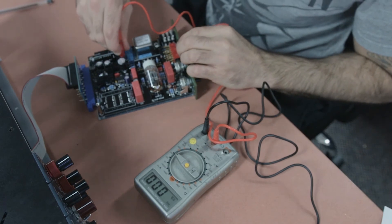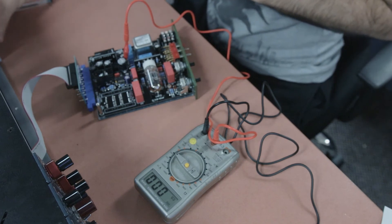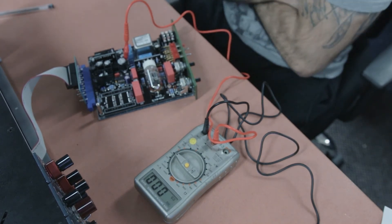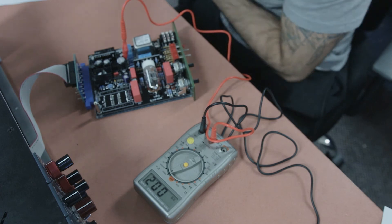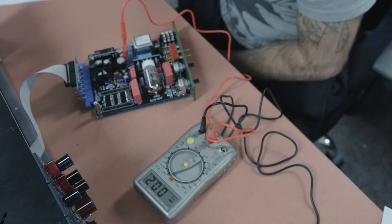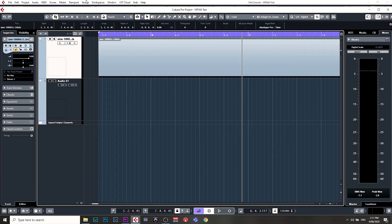The next step is the low voltage check. Disconnect those probes, take the red probe, and connect it to test pin eight. After 30 seconds — once the tube warms up — you should get a negative voltage somewhere between minus 3.8 volts and minus 5 volts, depending on the voltage in your lunchbox.